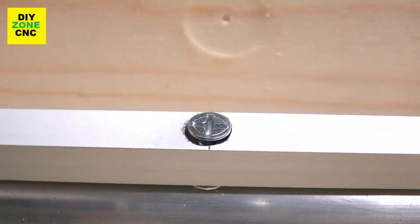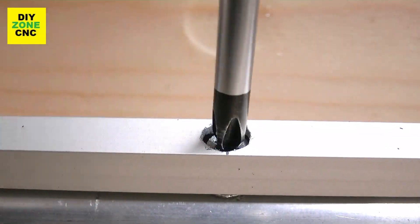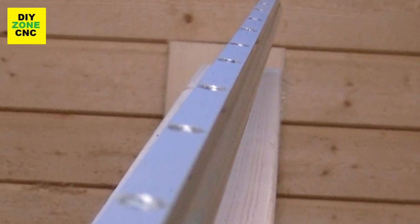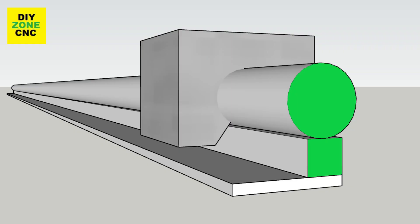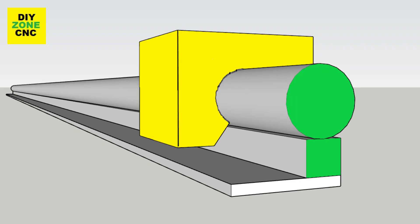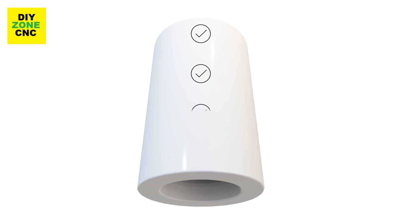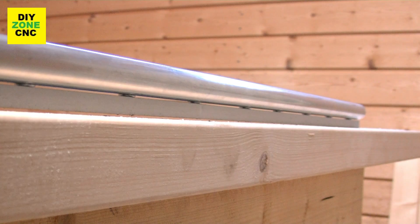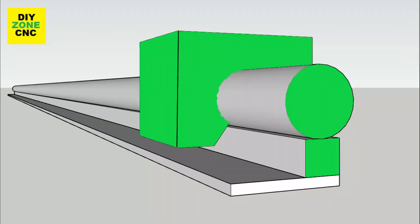As a result of that, you will end up having a very nice straight linear rail — you can see it and decide for yourself. Now the tubes are mounted together, we can test the functionality of the linear bearing rails. If there should be any deviation, it will affect how smooth the bearing will run. Because of the increased resistance you should hear a difference in sound as well. This sounds perfect to me — that is great news.